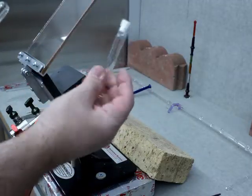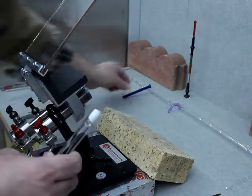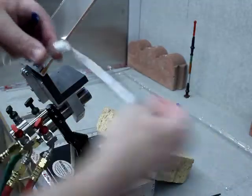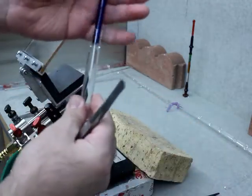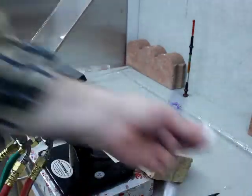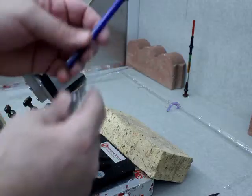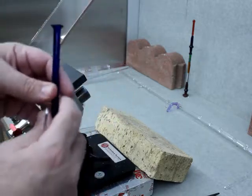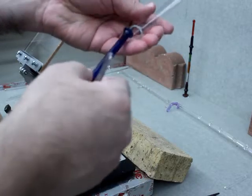I made this little inset earlier today where I cut it to length and put a couple of dimples in here, so that way when you put the tube in it seats in here but can't fall through. If I remove the kim wipe, you can see it's not the kim wipe that's holding it in place — it's these two little indentations. The little piece of kim wipe is there because there's a little bit of play, and that's intentional, so that way you just cinch it down by wrapping a little bit of kim wipe there. It could be thin cardboard or anything else. That one's a little bit wide, that's not going to work — this one's better.